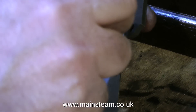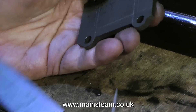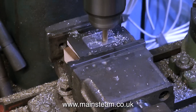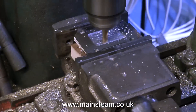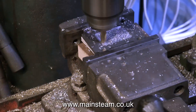Earlier I sprayed the front of the steam chest cover with some matte black paint. This is to allow marking out for the position of a recess that I'm going to machine in the front. This is the milling operation once again shown at a very high speed, milling the recess in the centre of the cover. This machined recess really finishes off the steam chest cover, and it should look great when it's finished and fitted.